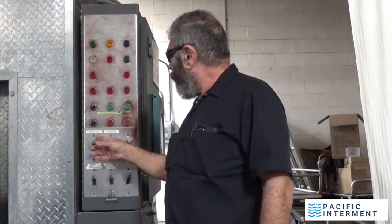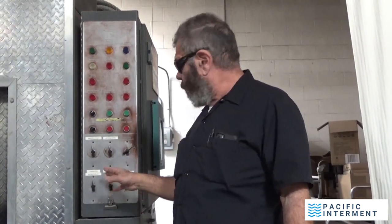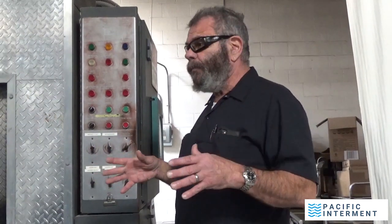And what I mean by that is, the master cycle, you give it, let's say, 2 hours, and in 2 hours' time, it's going to go back to zero, okay? Where on the hearth there, it's a delay. So when you time it forward, when you set the timer, what it's doing is it's delaying the process or the action, and it will time itself back to zero, and when it goes to zero, it's actually on. So I know it sounds a little confusing, but after a while you get used to it, and it actually makes a lot of sense when you have a chance to run a few cases through as you're training and learning the process.